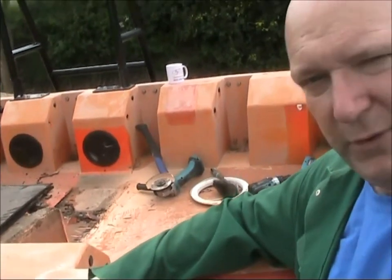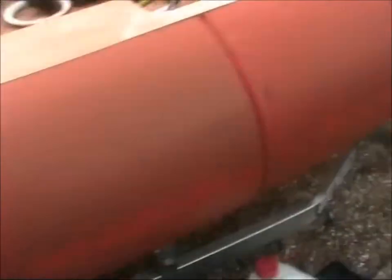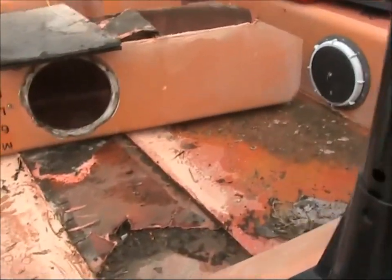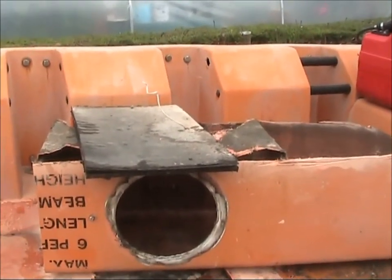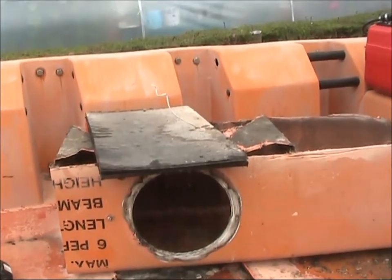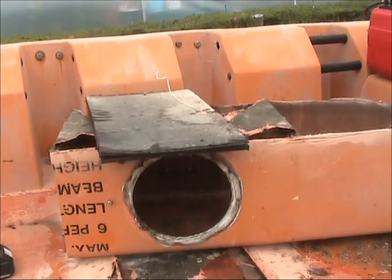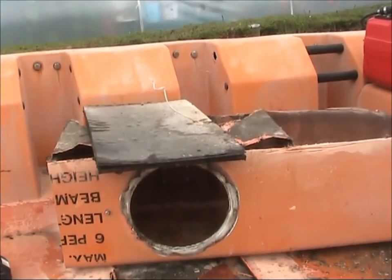While we're on the subject, I just want to show you this. If you're ever in the market for a new boat, always ask them what it's constructed of. Obviously it's GRP, and they'll come out with all kinds of specifications on the GRP and the resins and everything, and how it's all Lloyd's of London certified and all that. But if they admit to using plywood in their structure, walk away - don't listen when they say plywood's alright because it's encapsulated in resin, because as soon as you put a screw for any kind of fitting through your ply which is encapsulated, the thing is compromised.